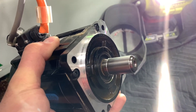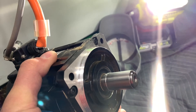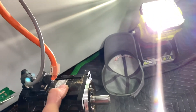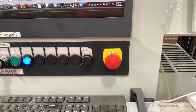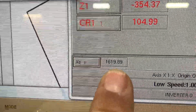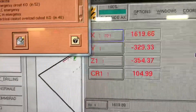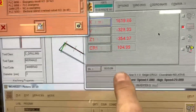Now that we have the motor out, we can turn the shaft. With control power on, the motor will be locked, so to turn it freely we need to hit the E-stop. Hitting the E-stop releases the motor so it can be turned. We then turn the motor shaft to adjust this number, and we want to get it within 0.2mm of the actual target value.